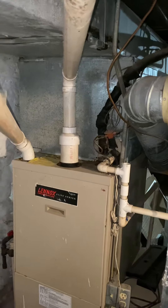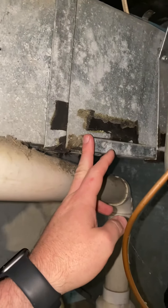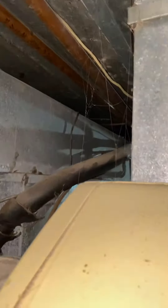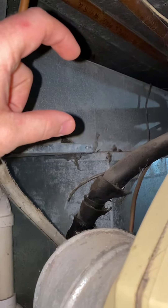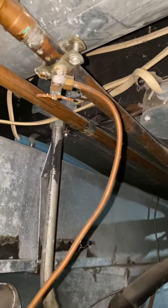I will follow up with Crescent and see if we've got anything that will fit 18 to 19 inches. If not, I'm thinking we'll probably end up just cutting out the plenum here — this ductwork from roughly this seam to pretty much the same on the other side. It doesn't appear to have a supply going straight above it; it's a return that's panned over the top. So if we put the coil in place and build a small — maybe six-inch — plenum above that, we can just run the supply directly into that coil on both ends. It's about the best I can think of off the top of my head.